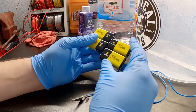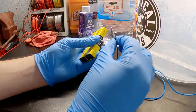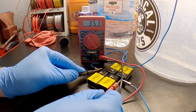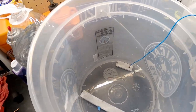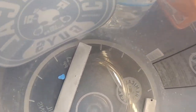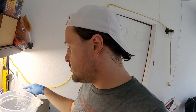Now with our nine-volt battery pack, we make sure the negative goes to the ground piece and the positive goes to the piece we want to anodize. Checking the voltage across the wires - it dropped to 35 volts because now there's a current running through the batteries. It's dropping pretty quick: 35, 34, 29 - it's going to continue dropping as current runs through the liquid. If you look down inside, you can see some bubbling - that's the electrolysis, which is going to put all those grooves in the metal. I'm going to let the batteries deplete themselves in the solution, probably about an hour or so.